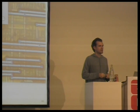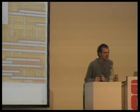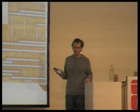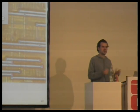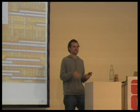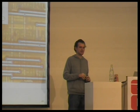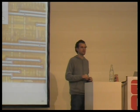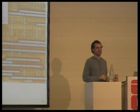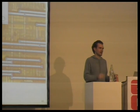Okay, the question in the back? Yeah, I think there's a high degree of automation in your image analysis. Have you considered using automation for the acquisition, maybe with CNC? So the question is, have we automated any part of the acquisition of the images? Sure, taking the images doesn't take all that long. Taking all the different images with a stage that automatically moves, which we're already using sometimes, takes maybe 5 minutes. So the polishing will be a bottleneck, getting just right to the layer where you want to be. I'm not sure how much you can automate that. Maybe you could build a robot that puts it in HF for 30 seconds and then takes images and repeats that. Yeah, we haven't automated that yet, no.